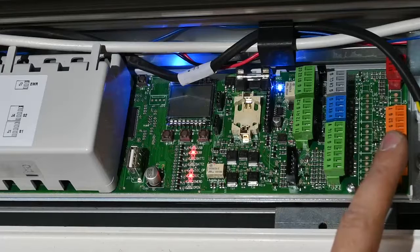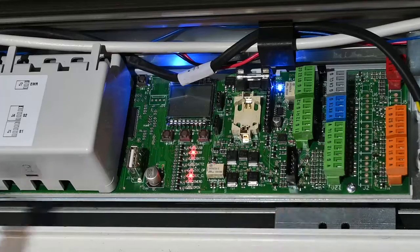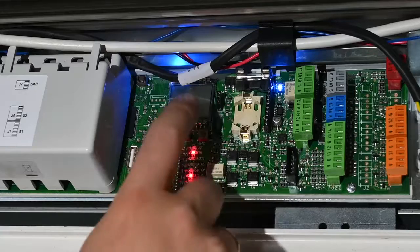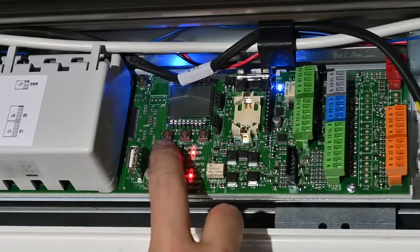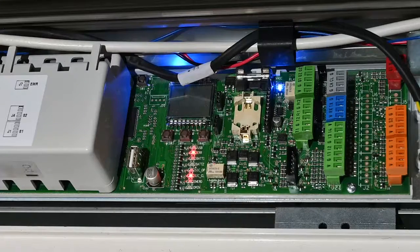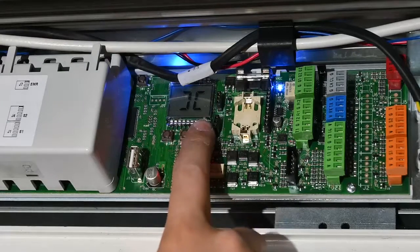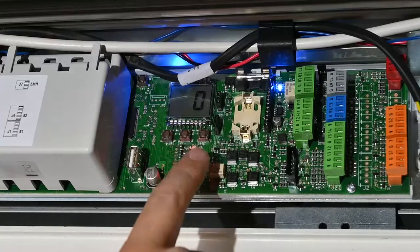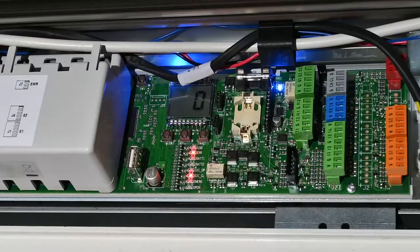The system does allow you to run a setup without it being fully wired. There are three buttons on the E1 SL control board: a plus, minus, and an F. The F button goes through all the different parameter lists. The first parameter is the back-to-back C's, which is ready for Simply Connect — we will have a video showing how to do Simply Connect at a later stage.